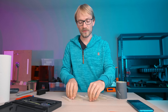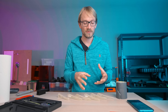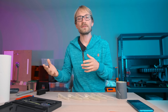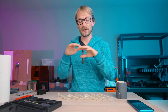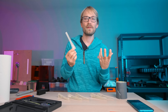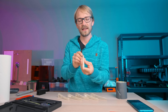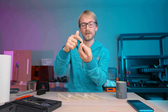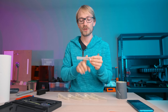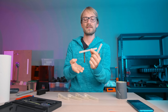This was a lot easier to do and to create than I was thinking. The material soaked really well in the fabric, the printer had no issues at all printing through this material. I gave it a 90-second cure layer when I added that second layer on the bottom of the part, but other than that I just used the standard settings of 60 seconds for the first five layers where it would impregnate that first layer of fabric. One thing I did notice on that first print where I had only one side of the drywall material in it is that this part actually curled and warped quite a bit during curing. I think that's because one side now has the reinforcement in it and the other side does not. So if you try this at home, you should always have both sides reinforced in the same way. In fiber layup, you would call this a balanced layup, where you have the same stack-up on both sides.